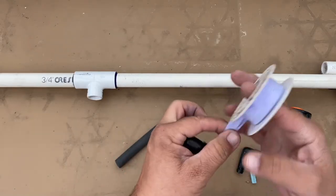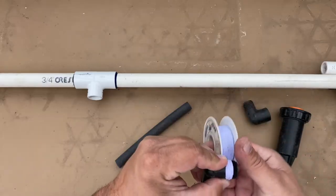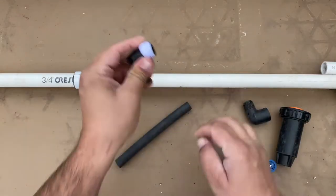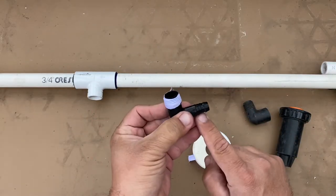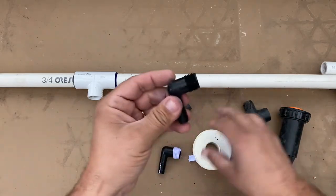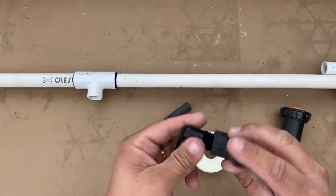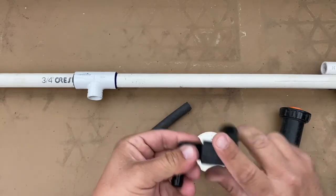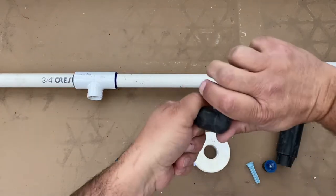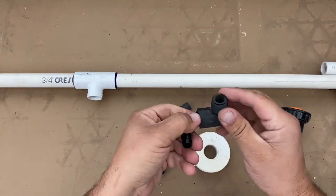The proper way to assemble a swing joint: you want to get your funny 90s or funny elbows — half-inch by funny pipe or swing pipe barbed fittings. I have two of them here. I actually don't have to Teflon this because it's a soft plastic that seals. This is a Marlex fitting — that is actually the name brand. I wind up putting it on hand tight.